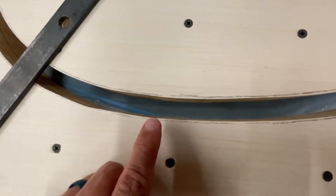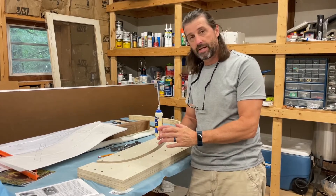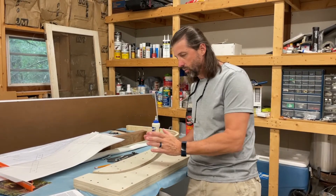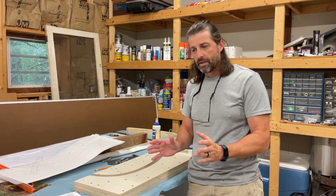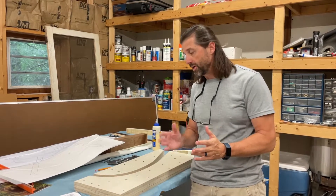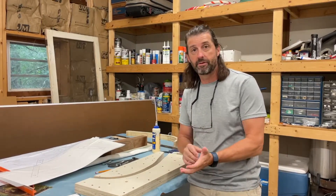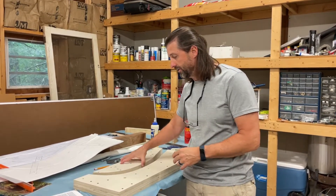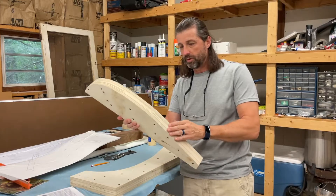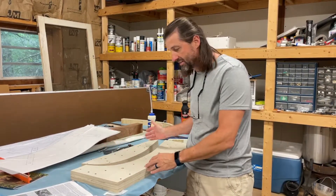In Bingham's video they show you cutting next to the lines like I've done, then using a drum sander — either on a drill press or a dedicated drum sander — to work it down right to the drawn line. On Trad Gang they discussed using a router with a flush-cutting bit and a quarter-inch template, which is probably the best method, but I don't feel my skill level is there. So I tried the sanding method on the top piece, got a good curve, and confirmed 90 degrees all the way across — so I'm going to continue that method on the bottom piece.